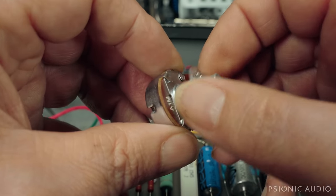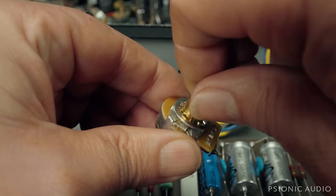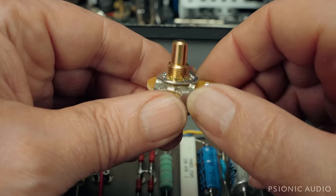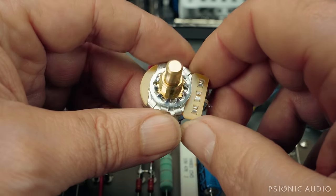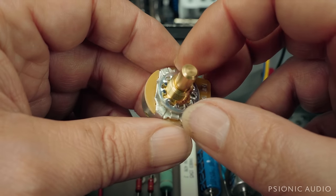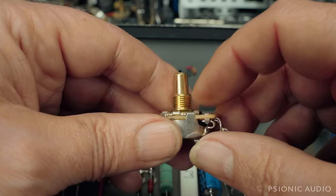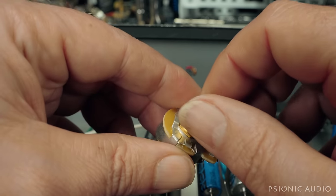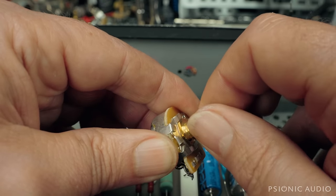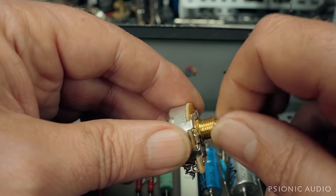Why would you use this alpha 24mm when you could use a CTS 24mm? This low torque one for a Telecaster I would use because it is a better pot, both in terms of feel and the taper. This vintage taper is nice — it's not as nice as the one that Mojo Tone does, that Emerson used to do, that RS Guitar Works occasionally does. This is the standard CTS low torque 10%; I prefer the 30% of the others. But a lot of the current CTS pots, especially the 1MB and 500K audios, have a dead zone where below 9 o'clock there's just nothing — it's loud and then no in-between. And that's a real bummer. As the AC30 uses two 500K audios and two 1MB audios, the standard CTS is not a good choice because of the dropout.